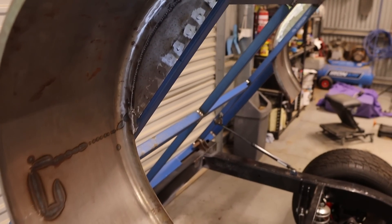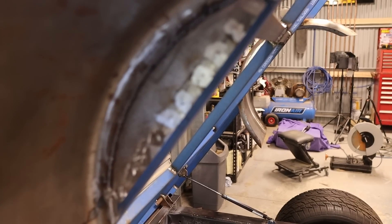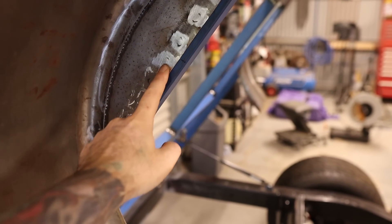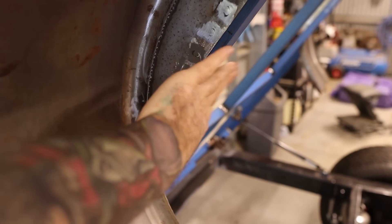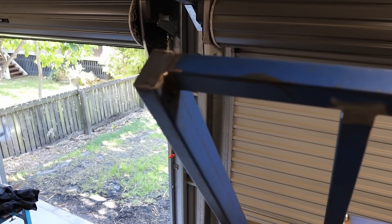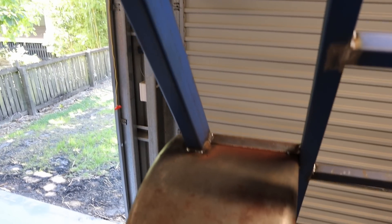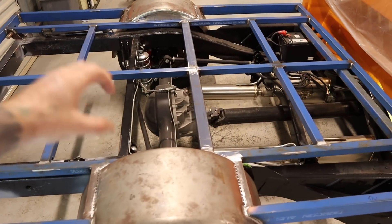With these infillers on the side, I ended up cutting out a half-round section and then welding that to the guard first. I had some holes drilled into this section here and just plug welded them to the side of the frame. With the ends of the tray I just welded in a piece there to block that off — I'll put some filler over that as well. I'd say the whole tray is probably going to need a layer of filler anyway just to get it all nice and smooth.